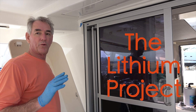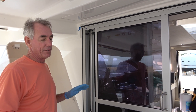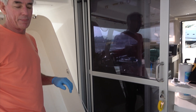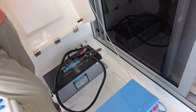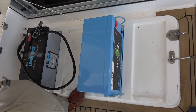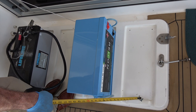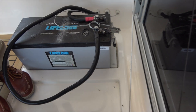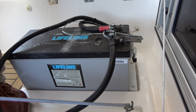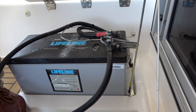We're replacing our old AGM lead-acid batteries with Relion 300 amp hour batteries. We have four AGMs that come standard in the Leopard, and the battery compartment is made to fit those AGM batteries. We're replacing them with three 300 amp hour Relions, with another slot available for a fourth 300 amp hour Relion down the road. This compartment area on the Leopard cat is made for that AGM lead-acid battery in terms of width and length, so they don't slide around while sailing. They put a small piece of starboard at the end to help keep it in place.